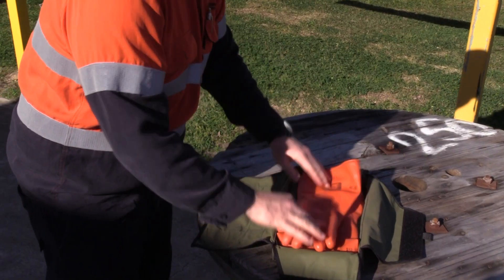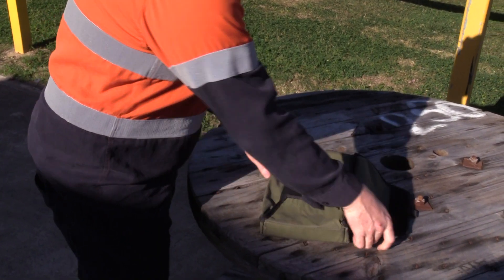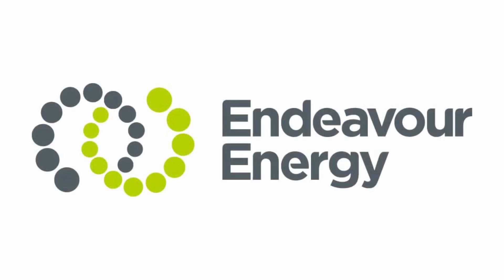That's how we test our gloves. Just remember it is your responsibility to perform that test before you use your insulating gloves, making sure they're in good condition. When storing your gloves, separate them from the leather outer and keep them in the canvas bags provided. I hope you found that video useful, and if you want more information, contact us at technical training.